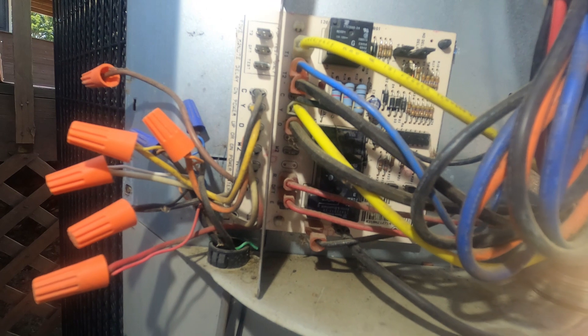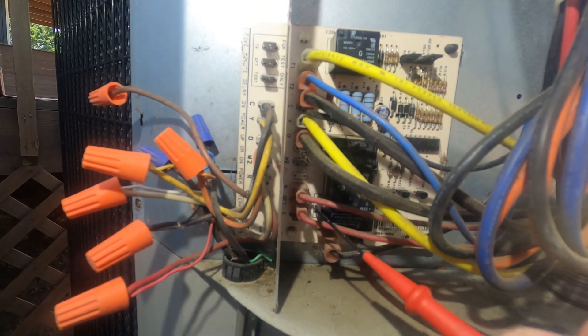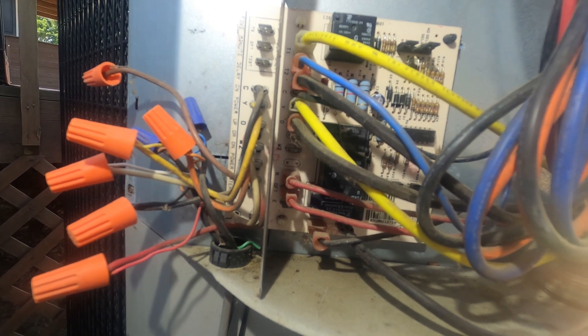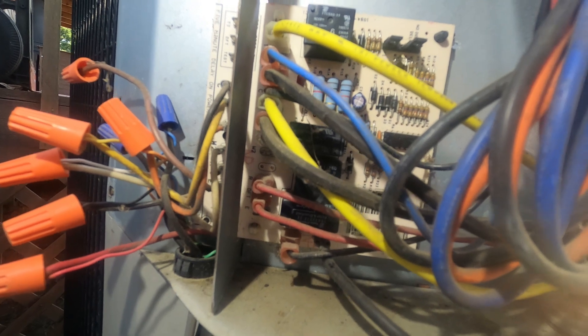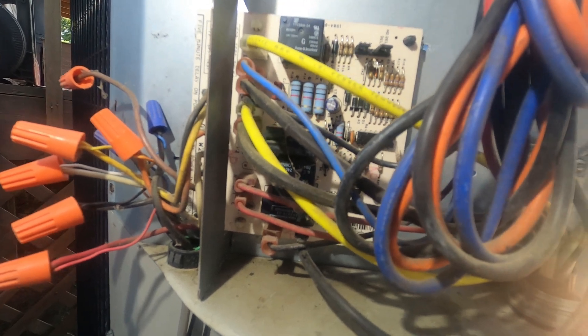Troubleshooting it is pretty simple. I'm just going to check and verify that your switch is closing. If it's 50 degrees outside and your switch isn't closed, you're running in heat mode and maybe that coil isn't cold enough to close the switch — so you can test the cycle. Just disconnect one of your fan wires off of that board, turn off that fan, and continue to run the heat. Without your fan running, this coil will get cold, eventually it will start to frost, and you can confirm that the switch does close when the coil gets cold.